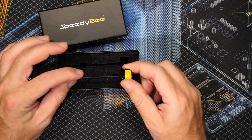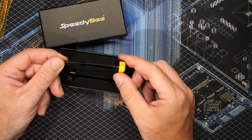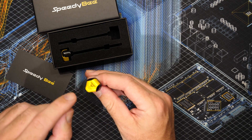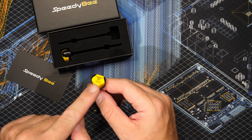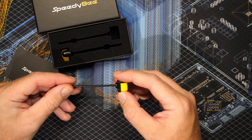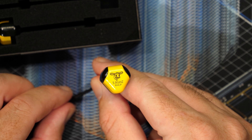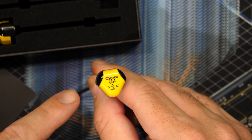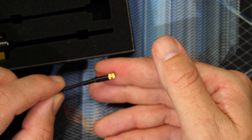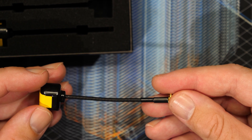The three smaller connection versions are roughly the same length — this one has an 88mm total height — however the SMA version is down to 70mm. Looking at the top, it has a width of about 20mm and is made out of hard impact resistant plastic, coloured yellow which makes it easier to see. The antenna is fitted with a flexible but non-rigid coax, meaning they'll move but won't stay where you leave them, so you'll need to tie them down. They're made from high strength PC and ABS material with a heat-shrunk MMCX termination at the bottom.